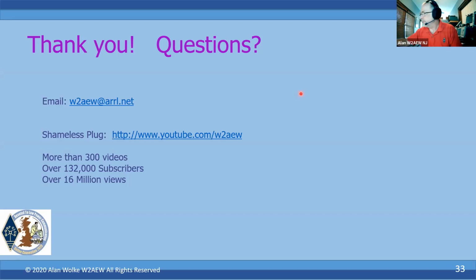I don't know if you guys have got my video up or not, but I've actually got some SMA connector savers attached to mine. So I do all my connections to these connector adapters. I did my calibrations to these connector savers, so that if I damage this or wear it out by using it a lot, I can pull it off and put another one on. So I save the wear and tear on the SMAs. But certainly if you have another connector style that you use most often, like a BNC, you can use that and run the calibration to the end of that, or even use port extension to the end of those adapters.